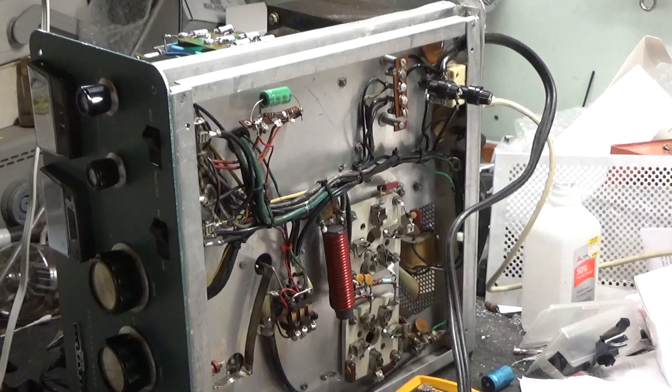He has a Harbach board in there. So I had the meter protection diodes, thankfully. That crowbar circuit stops you from getting electrocuted, or at least helps. High voltage will kill you. It's very dangerous. So if you're going to work on one of these, make sure you know what you're doing, or just send it to me. It's not worth getting electrocuted to try to save a few dollars, or you could end up doing a lot of damage like this. So the circuit breakers were damaged, so I ended up putting in temporary fuses.